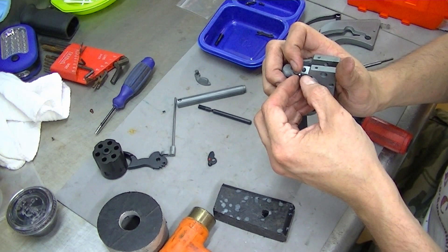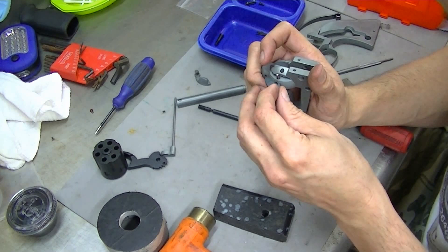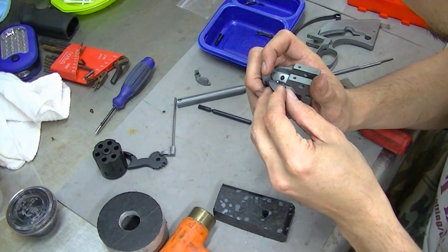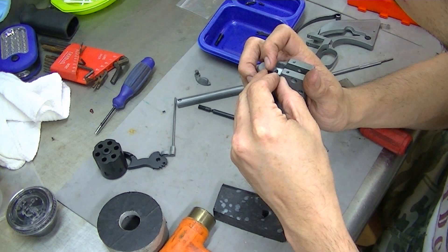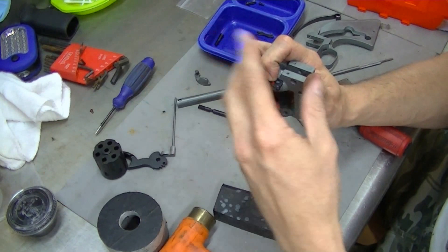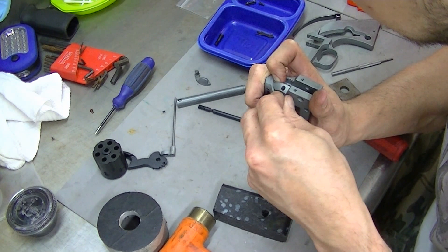I've set the spring and the detent ball in there. Now I'm going to take my plate. What I did last time was let that detent ball go right through the screw hole — I'm not going to do that this time. What will really help you is being as square as you possibly can. If you let that plate angle at all, it'll send that ball somewhere it doesn't belong. Then just slide it up — you'll feel it go through the detents. Slide it right into place, just like that.